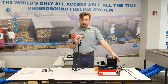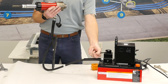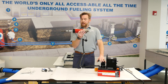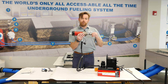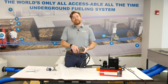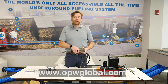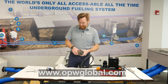Now once we've made our swedge, you'll see that this does not automatically return. You'll have to take the toggle switch and move it to the farthest position, go past the middle position, and then as you get it to the return position, you'll start to see that the mandrel will start to bring itself back through. So we're really excited for everybody to continue using our new BVA swedge machine along with our DPC couplings. We really think that it's one of the best ways to maximize all of the benefits of our FlexWorks system. If you have any questions, please reach out to the DM in your area or go to opwglobal.com. Thank you — we'll see you next time.